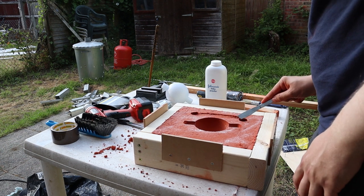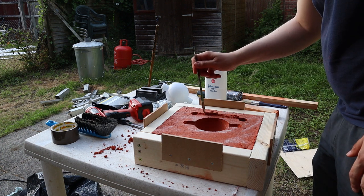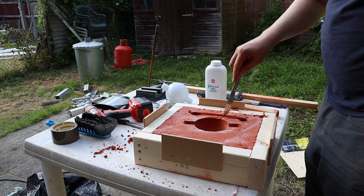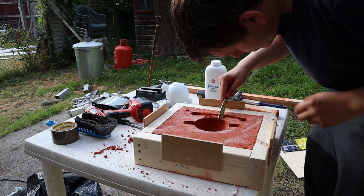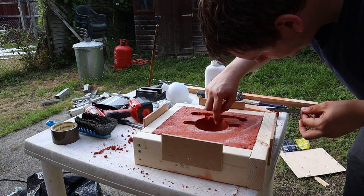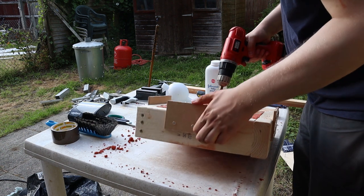One of Paul's ideas I'm vaguely trying to copy here is to have the aluminium flow past the gate for the part into some form of spin trap to stop the liquid metal bouncing back into the part. The metal initially is full of bubbles and loose sand, and this gets pushed straight past the part into the spin trap, leaving the cleaner, less turbulent metal to overspill and fill the part.